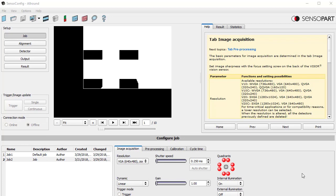One of the new features of the robotic camera, also in the all-around professional, is to check a part for free gripping space. Before a robot grips a part, you want to be able to check that there's enough space for the gripper on either side. In this case, if we want to pick up some of these blocks off a conveyor, there are four candidates. If we're picking it up by the long edge, there are two different good candidates — you may want to prioritize the one nearest the fixed stop or the one in free space.